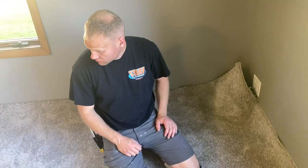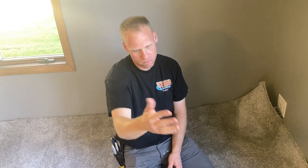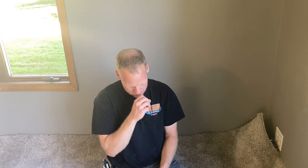First thing, you guys are in for a treat. We've got a lot of wonkiness going on in this piece, and I knew it. Another good reason not to cut your fill, probably from the end of the roll of carpet, was just this. At the end of the roll, you could see where it was rolled up and stretched. And when I went to run my rows, they'd snake in, they'd come out. Now, I probably could have got by with straight edging that, and even though I would have had some colors kind of crossing, this is a light color, I think I'd be okay. But you know what? We always strive to do the best job we can, and truthfully, I've done this long enough. By no means am I an expert or a master, but I enjoy a good challenge.